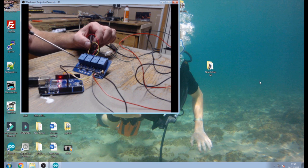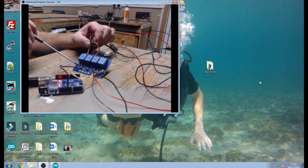A little bit about these relay boards — these are the boards designated for Arduino use. You can get them from different manufacturers; you don't have to buy them directly from Arduino. There are quite a few cheap ones from China, but you do need to get the ones with the optical isolators on them. These electrically isolate — because they work by light — the digital outputs from the Arduino from powering the coil of the relay. It's important to have this to reduce the back EMF that could go back down into your Arduino and damage it. An optical isolator is the best and safest way of doing it, and these boards are really not that expensive.